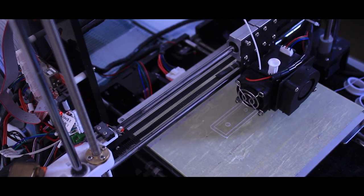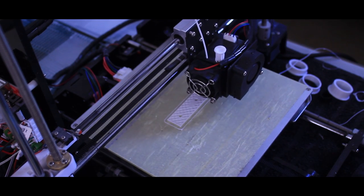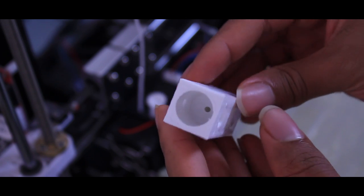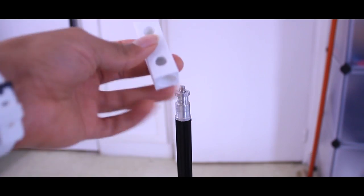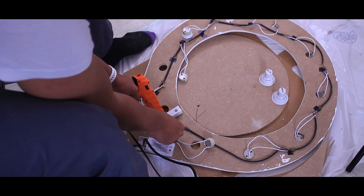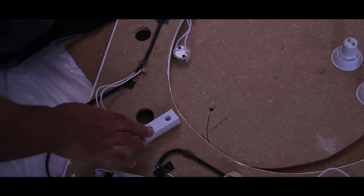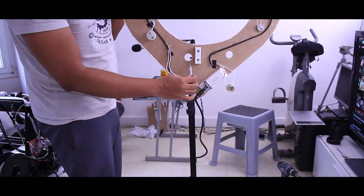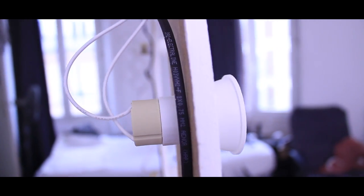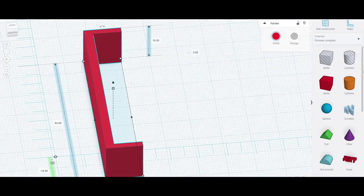Here I am printing the mounts I designed — basically how the ring light would mount onto a light stand or a regular tripod. This is what I came up with. It's actually really really small — I thought it would be bigger but I clearly did not measure enough. Those two holes are for screwing it into the board, but I also hot glued it, and as you can see it fit perfectly. It's still very small and I'm still impressed at how sturdy it is. You can see me putting it on my light stand. The separator is the only thing holding the light bulb in — it's snug and it's perfect, even though I had to redesign it three different times.